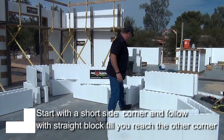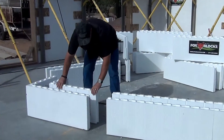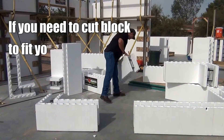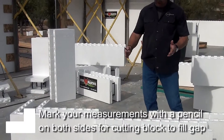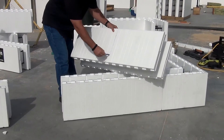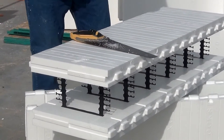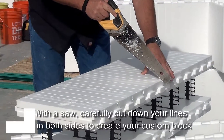So we're going to take the short, place the long, place another long or another straight, and then start in the corner — just simulating that this would be the size of our wall. So we'll take a block, and no matter if it's four inches or three feet, we're just going to mark it so we have a nice mark, mark the other side. Many options for saw — a lot of people like the pruning saw, they fold up so they're kind of a little safe. I prefer just a regular hand saw, and we're going to cut through the block.